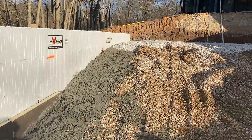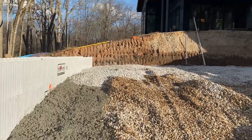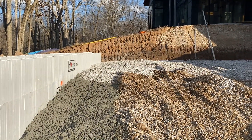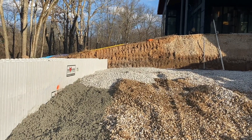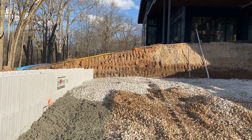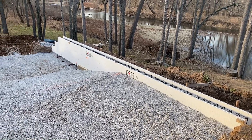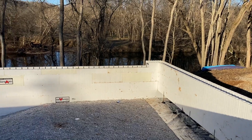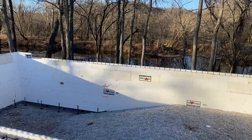We poured really dry footing concrete — just a cheap footing mix like an L3000. Now they're going to bring the gravel over like they always do, and we're not worried about it trying to cave in. Especially after tonight, this will cure out and we'll be able to drive a skid steer near it if we want to. It gives you a lot more freedom than the way we've done it in the past. Now you can see what it looks like when we get the gravel done right before we start stacking the blocks — removing the 12-inch strip along the gravel so the concrete can flow through — and bringing in the dowelboard. This has been the best method we've used thus far.